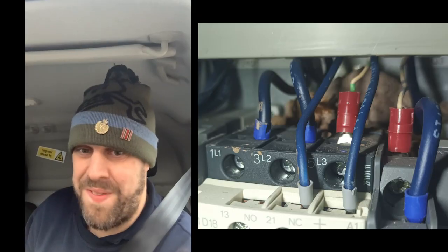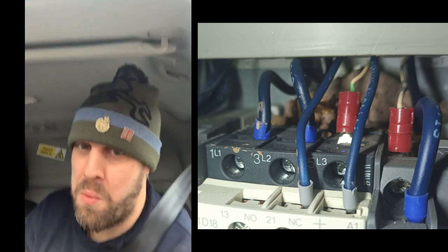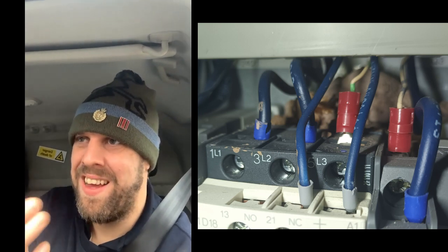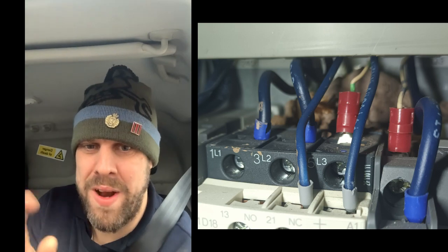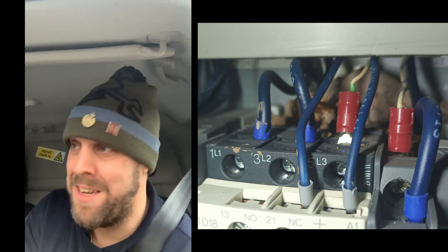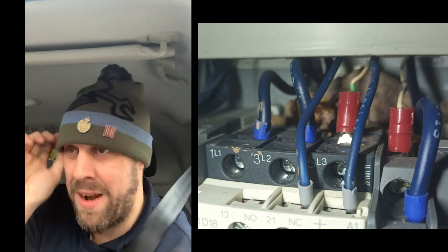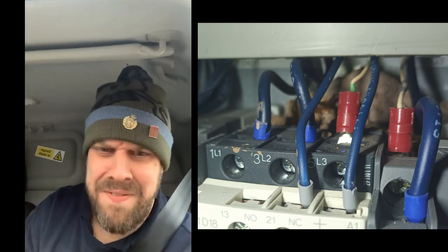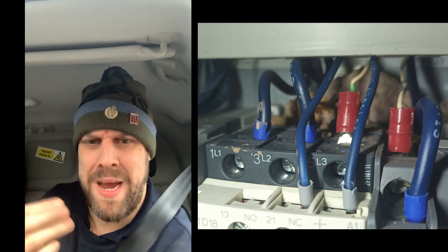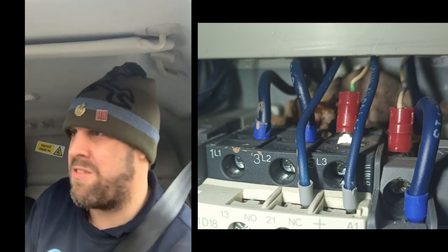So what I found was, on that stiff contactor, on top of it, there was a wasp nest, which looked like plaster dust, but when I undid it, there's like these yellow cocoons inside, and I suspect that's crumbled and gone in the contactor, and that's what's messing it up. I've got some pictures of it. I'll put one in a bit. I'll make it into a story. I think wasps eat stuff and mix it with spit, and it's like a brown plastery type substance. I suspect that's gone in the contactor and is what's giving the trouble.